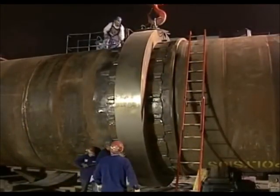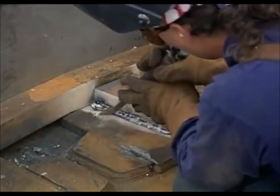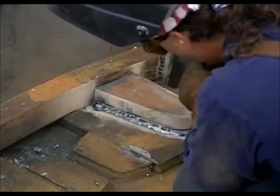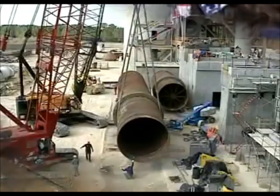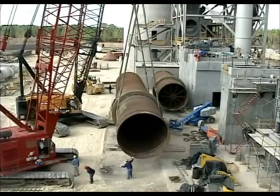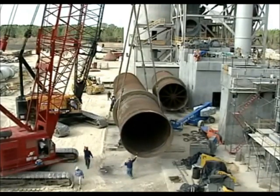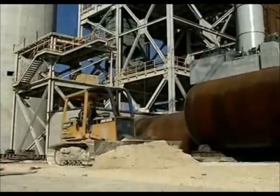The support rings are then slipped into place. Only after the completed shell is placed onto its support rollers on the pier tops will the tires' positions be permanently fixed. The size of these sub-assemblies is only limited by the available lifting capacity and by the obstacles that must be avoided in getting the shell sections into position on their pier tops.